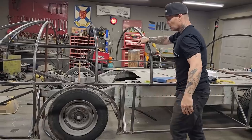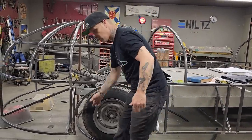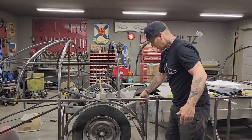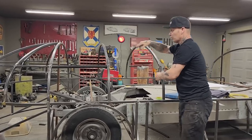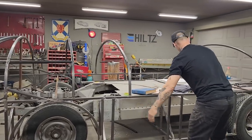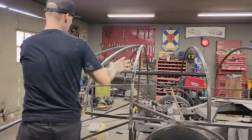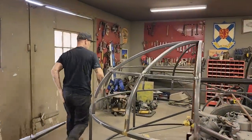When I get that piece on, I'll be able to come in on the inside and cut that shape out. Then I will know exactly where the wheel well will be, because I'll have sheathed it. I'll be able to go on the inside and cut that, come in from the front or wherever and cut that out. So then there'll be one sheet here. I'll go to the other side and flap another sheet over that side. We'll meet up in the middle on this piece of square stock that runs in the middle. And then we just continue on. We got halfway here. We'll make sure we have a 4-foot center here. Piece of metal flat, roll it all the way on, and so on. The ends, this stuff here at the end, is going to be the issue. But other than that, it's going to be pretty basic, I think.